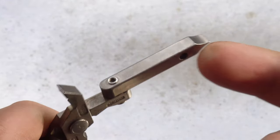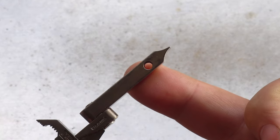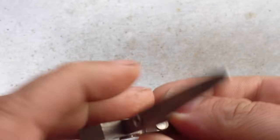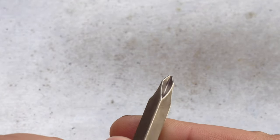On this arm we have a flat screwdriver. You can see how that's shaped by two concave hollow grinds, whereas on a more recent one they've just got two flat grinds either side. On the other arm we have a Phillips. You can see the machining marks where this was made, whereas the more modern ones you can see they're being cast.